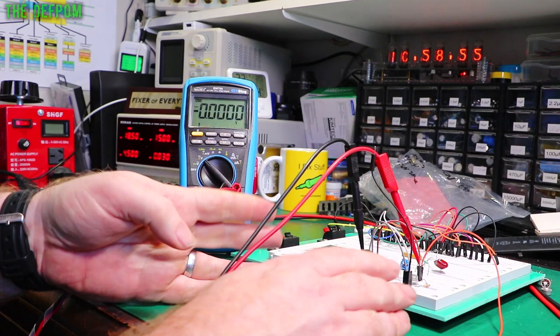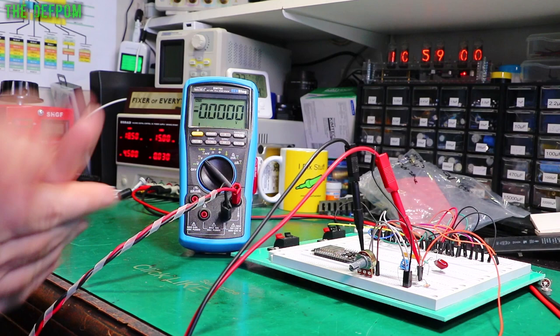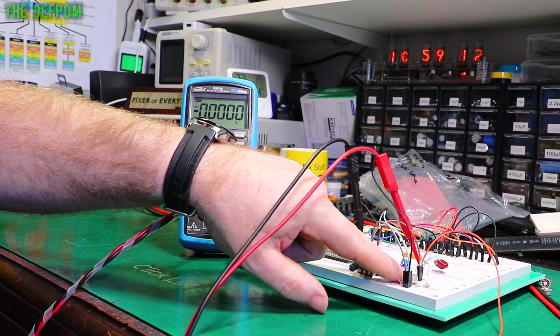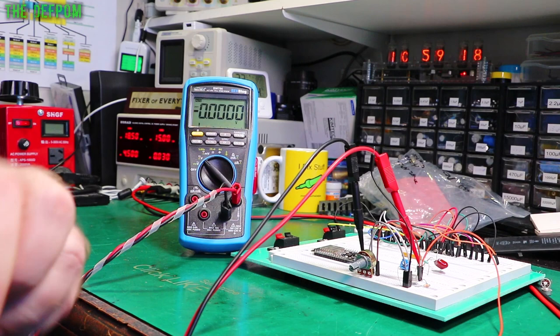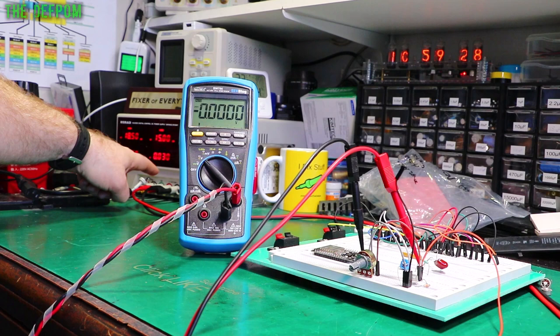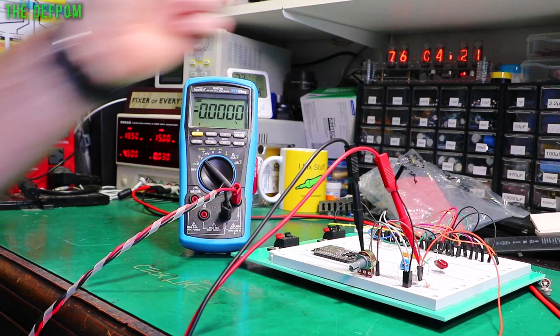I've set up a little test jig, so I'm going to try these op-amps out one by one. I haven't powered this up yet, but I thought I'll do this on camera in case it goes bang or something. I've got a variable pot to test the voltage going into the input, and I've got this set up for 10 times gain. I'm running 15 volts on the power supply at 20 milliamps, quite restricted, with my multimeter set up for volts directly on the output of the op-amp.